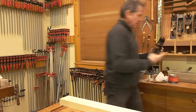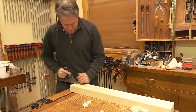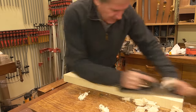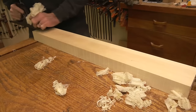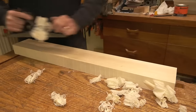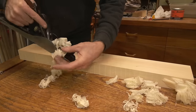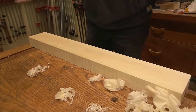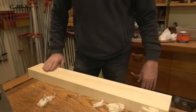I'm going to grab the number five — this is my usual plane. Let me dial it out a little. See — nice, same result. I am not working hard at all. All I'm doing is holding the nose down with moderate pressure and pushing it through. Look at that — it's just like glass. If I stay even with my strokes I'll maintain square.